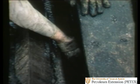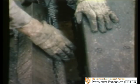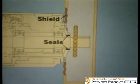And then check the pleated rubber diaphragm, which protects the seals and pinion shaft. The rotary table tends to move quite a bit when the drilling gets heavy. So to allow for this movement, there is a pleated rubber diaphragm which permits a flexible connection between the chain guard and the rotary table. If this rubber flex shield is slashed or damaged in any way, the mud, which has seeped down into the chain guard, will start wearing away the drive chain and the pinion shaft seals.